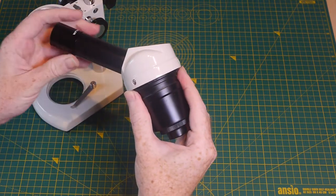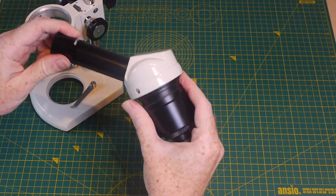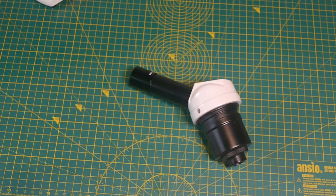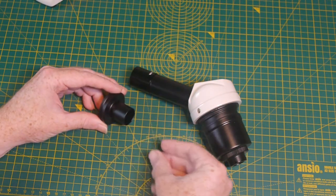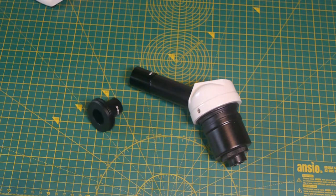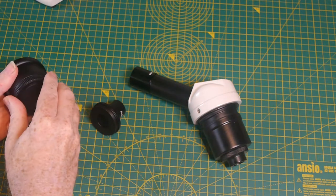As I was keeping it in working order, I looked into what was required to fit my video camera to it, so you can look through the lens as well. It has a 23mm eyepiece, so I bought this, a 23mm microscope eyepiece adapter with T2 mount thread, and this T2 to micro four thirds adapter to fit my camera.